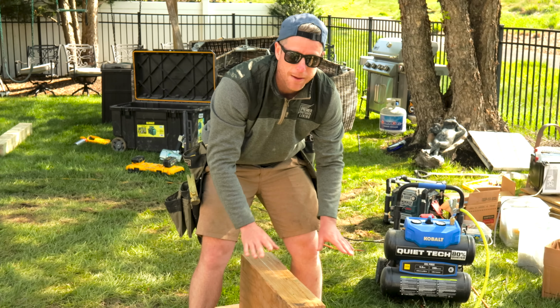All right, you can see we've got the 5.5x12 LVL ridge beam. You can see it's supported on both ends. So that is really gonna carry a lot of the load for our roof structure, especially because we have somewhat of a low pitch. That means a lot of that force is gonna be applied at the ridge. And that's why we wanted to have this ridge beam instead of it all being carried by our side walls. That's part of what is gonna make it possible.